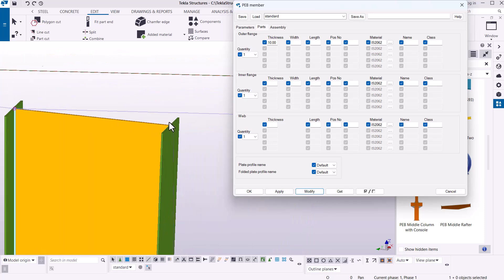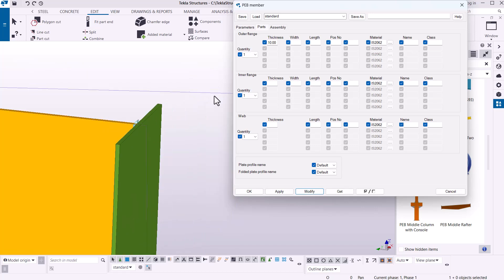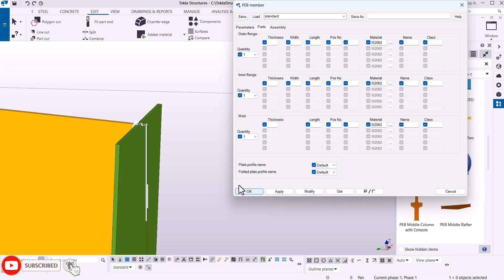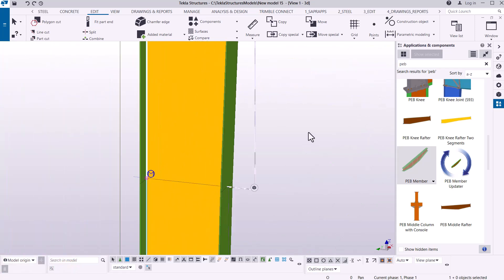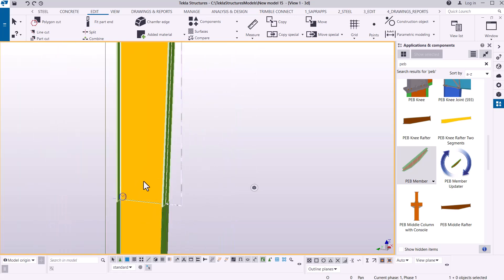The web has changed to that thickness — you can see that. I'll clear that field and retain the default settings. I'll double-click on it to link up with the dialog box, click apply, and give it an OK. If I zoom out and come to the bottom end, you'll be able to see we are well connected with the bottom-end column.